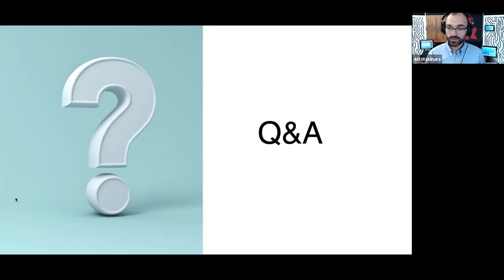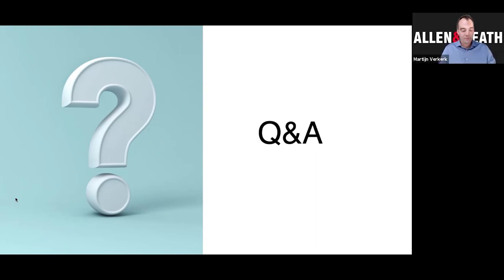Thanks for that. And a question from Jason about using IP controllers with third-party systems like QSYS. This is a very common question that we get. So do you want to answer that one, Martijn? Yeah, that's a really good one. So there's no real paperwork to use them. We are using a proprietary protocol, which is called AHNet, which we use ourselves. There has been some discussion if we could implement that directly into QSYS. Right now, the simplest way is to simply buy an AHM64, use the drivers inside the QSYS system, which can communicate with AHM64. And to be quicker with your question, probably, is there a driver for QSYS?